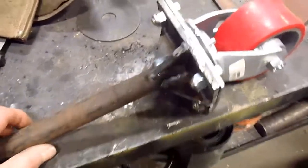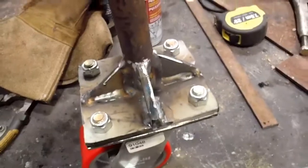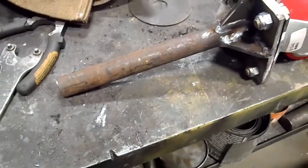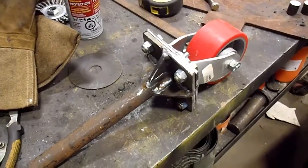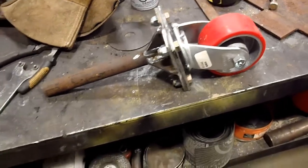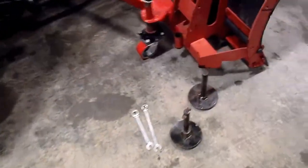Here's what I ended up doing. Here's the post of the plow — I had to gusset that a little bit because it definitely would bend if it hit something. However, with a plow wheel, if it does hit something it should roll and lift over instead of getting hooked and bending the post. It's just one-inch bar stock. I need to drill my hole and paint this up. Right now I'm pretty happy with the way it looks.